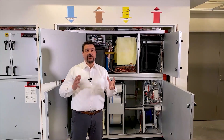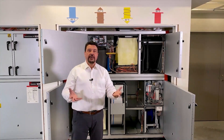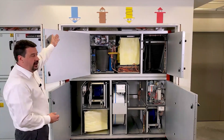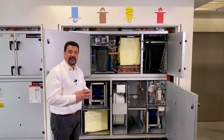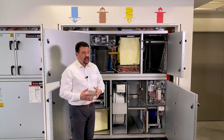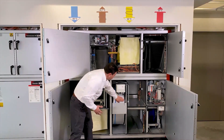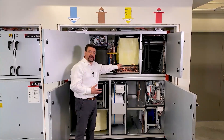However, this is a reversible machine, which means that what is a cooling machine in the summer becomes a heat pump in the winter. So if we have say minus 20 degrees outdoor temperature, we still want to blow in 20 degrees supply temperature. We have 22 degrees in the extract and we of course want to recover as much as we possibly can. So first we recover what we can in the thermal wheel and then we take the additional heat from the heat pump coil.